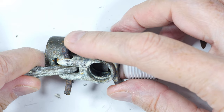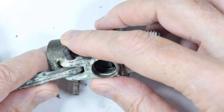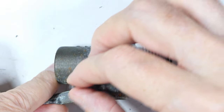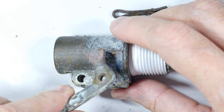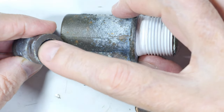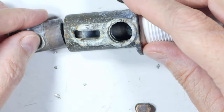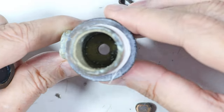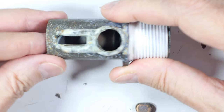This pin is either brass, copper, or stainless. I've seen people replace them with nails and that lasts at most a couple of months — then the whole thing falls apart and you end up with pieces in the bottom of your tank or trough, and you have to fish those out. You don't want them going through your pumps. So we remove this pin and you can see it just has a finger on it, and what it's doing is pulling this piston in and out. This piston has a rubber piece right here. I tried replacing it with silicone but it doesn't work — it doesn't last. So that goes in there and seals that hole off. The more the ball floats, the more pressure it puts on here to shut that off.